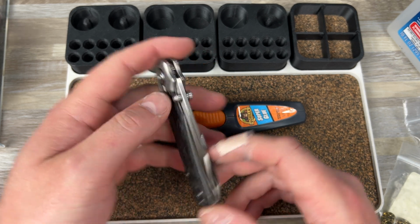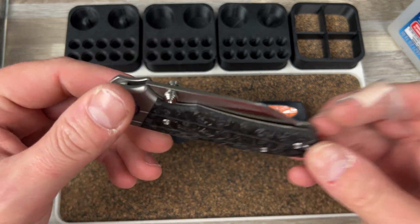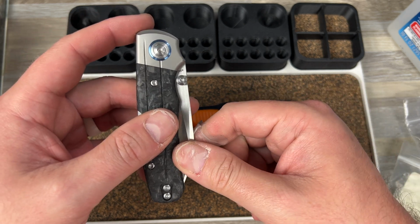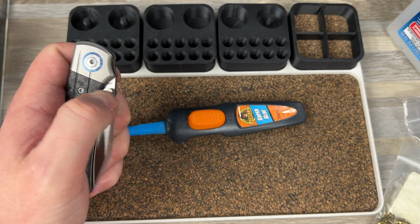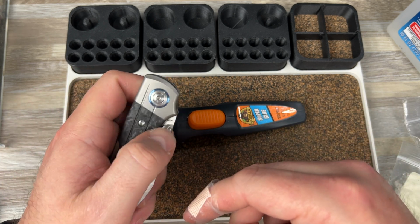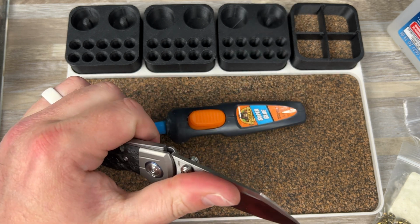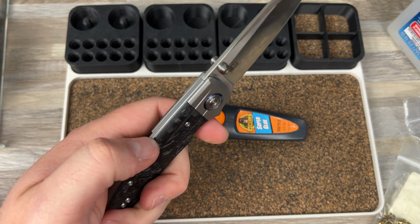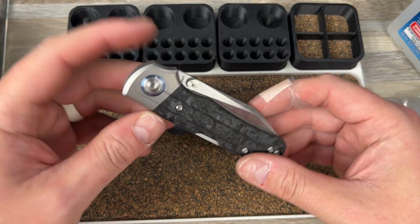So, yeah, I love the design. That's the thing. I love the design. I love that it's a backlock. We want to try to limit this gap right here. So you have to push to here, and then you hit that detent ball. So you can do this and then pop it. We want to try to make that line up to where you're basically hitting it immediately. But, you know, it's going to be difficult. You hear that click back? That's what's hard about it. You got to get it past and keep it past. So I'll see over time what happens here.